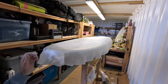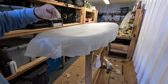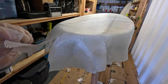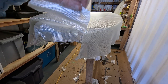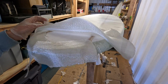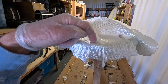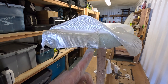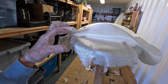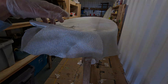At the nose, we have a similar cut — there's a cut coming into the stringer there, another cut coming into this stringer, and a cut through the center. If I fold the lamination back, you can see the patch. There's a small cut there, a small cut underneath and on top, and then a small cut on the stringer as well. That will allow this to all fold around that corner neatly and not create any bubbles. And then this one, of course, is on the top. Now we're ready to start setting up for resin.